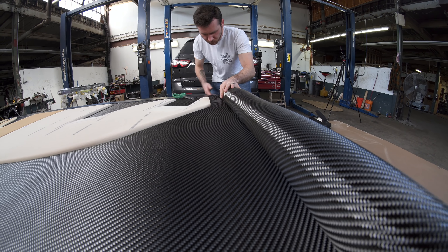Cutting the carbon Kevlar — I just used the same stuff I've always been using, but it frays up a lot. You have to go down to a lighter grit and sand it — it just takes more time. Doing it again, I don't think I really need to cut and shape the holes for the scoops beforehand. I would like to have it flipped so the underside is down against the table, because then that makes the underside the smoother panel. I matte-cleared the Kevlar side of my splitter like two times so it's at least smooth enough. For anyone who wants me to make one, I'll do it in reverse — the top will be the dry carbon look, and the bottom will be glossy, shiny carbon.